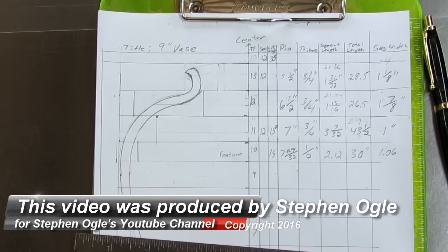That's how we're going to plan the rings. I hope you enjoyed that and got something out of it — it's kind of dry, figuring this stuff out, but if you do your calculations correctly, that's your basis — that's where it all stems from. If your calculations aren't right, you can really mess these things up. With 12-piece segments, if your segments are a sixteenth of an inch short, you're about three-quarters of an inch off by the time you finish cutting all your segments. I generally don't go more accurate than a thirty-second of an inch.